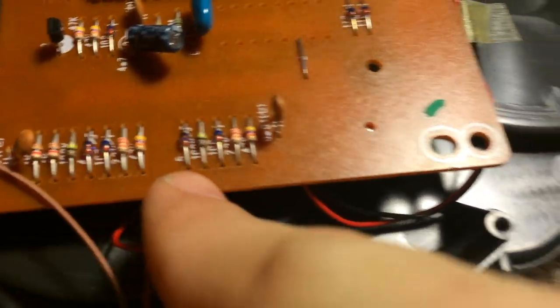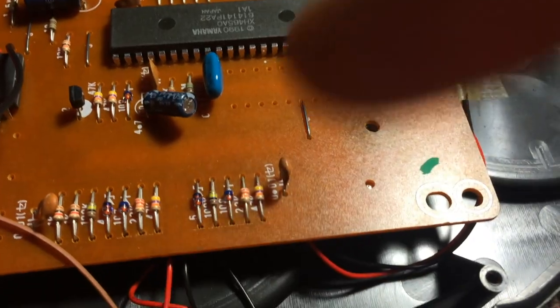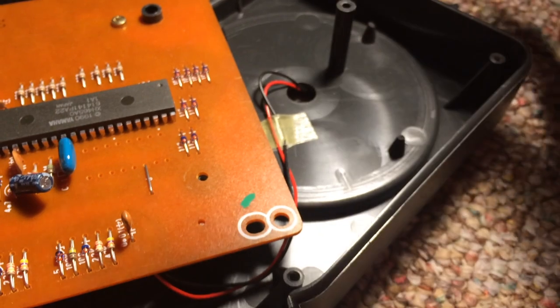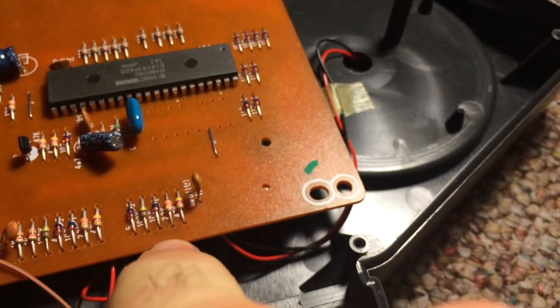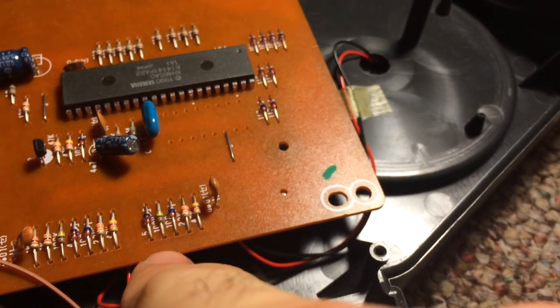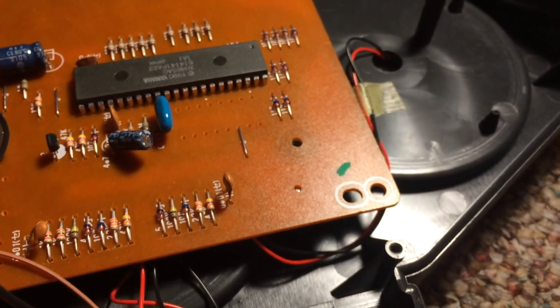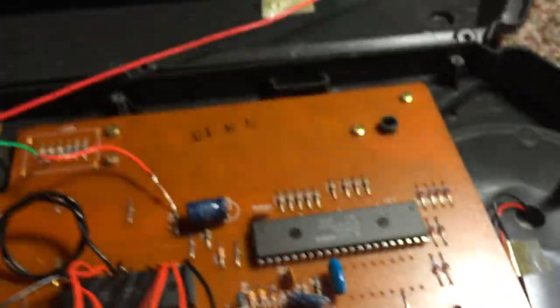I traced these back — these are the protection or conversion circuits for the pads. The pads have a piezo disc on a big metal plate with rubber on the top. These pretty much bias the signal. There's a zener diode just to help cut it down, because a piezo can put out a lot of voltage, but you don't need all that voltage. So that goes into the micro on the other side of the board.